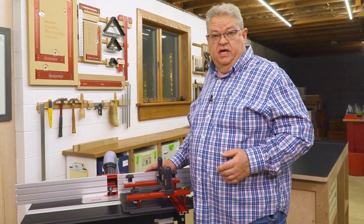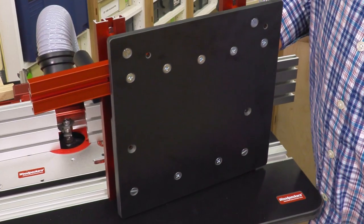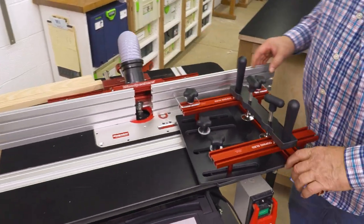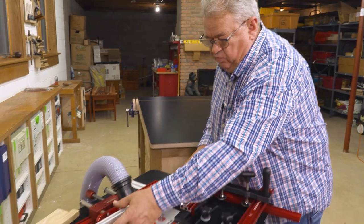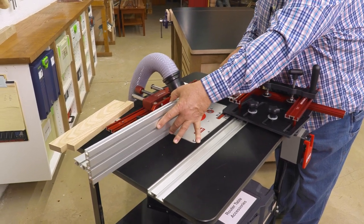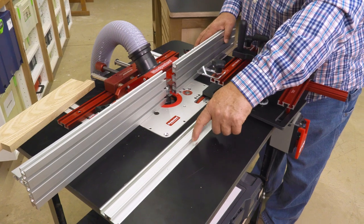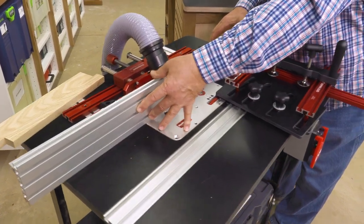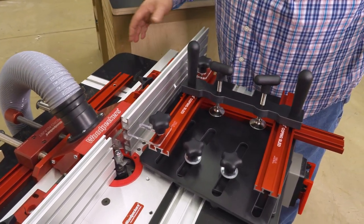So what makes the Woodpecker's coping sled the best option for end grain cutting? Something that's not there - notice what's not on the back of this. There's no bar. We're not riding in the T-track, the miter gauge track of your router table. Instead, we're actually guiding along the fence. Any time on a router table, the alignment of the fence really doesn't matter - the cutter is at the exact center of the fence cut. This doesn't matter whether you're leaning in or leaning out, unless you're using the miter gauge track. If you're using the miter gauge track, then the track and the fence have to be parallel with each other. So by guiding off of the fence rather than the track, we have perfect alignment every time and a lot less hassle in the setup.